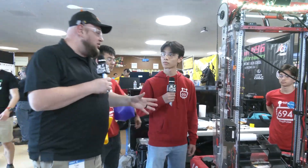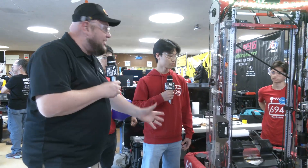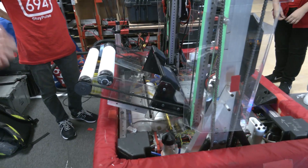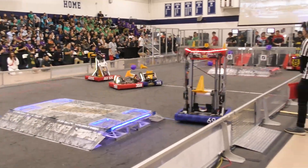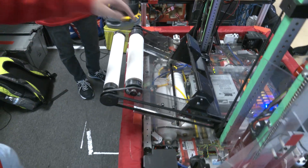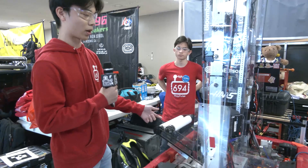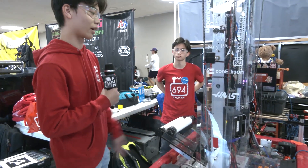Aiden, let's start talking about some of the scoring areas of your robot. I really love this arm overall and the intake that goes with it. How did you come up with this design? So when we started making our intake, we really wanted to pick up cones off the floor from the first substation. We thought that picking up cones by the flange would be the easiest way to always get the cone no matter what orientation it's in. These two rollers pick up the flange, and we have this area in the back where we pick up cubes. Throughout the season we've iterated a bunch of times — we staggered the bearings and rollers to pick up cones better.